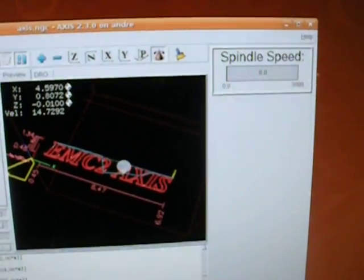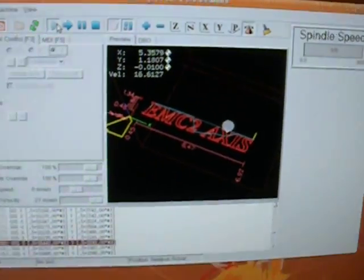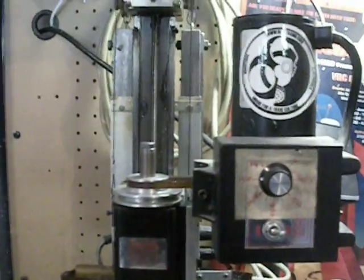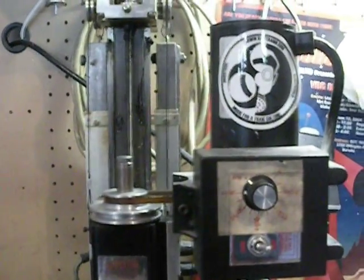You'll note I haven't hooked up the second printer port yet — I do not have spindle control back on the head yet. But soon I'll get a new spindle and we'll have that. This is all currently being cut on the stock Sherline spindle. I think I'm getting around 5,000 RPM maximum speed out of this thing right now. I'd like to do better — there are plenty of people on eBay selling better spindles, so I'm going to try one of those.